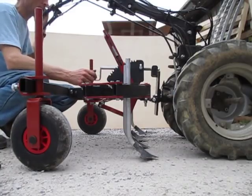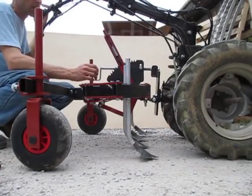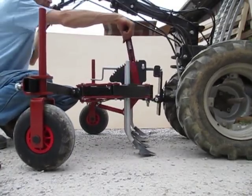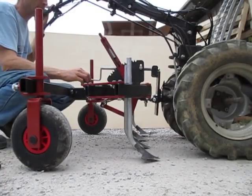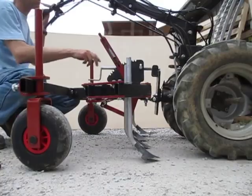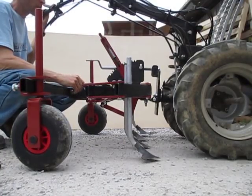Walk-behind tractors are not as tall as four-wheel tractors. The pivot points on this thing — there are a lot of pivoting parts that move in and out as the whole frame moves in and out. It's a good idea to keep a little lubricant on those from time to time. If they get rusty, they're not going to move so easily. Same thing with the screw crank for the angle adjustment — you can lube it at the points where it passes through the pivot assembly. That keeps it in better shape and keeps the squeaks down.